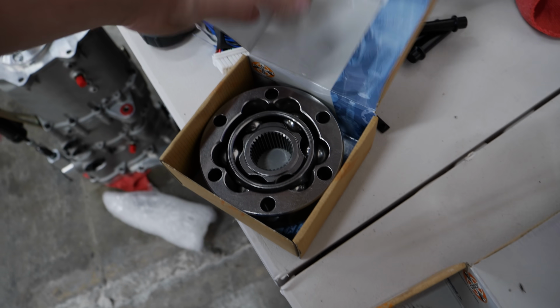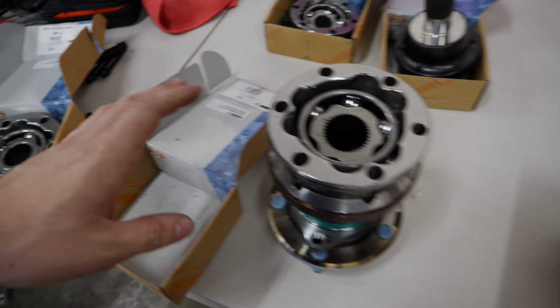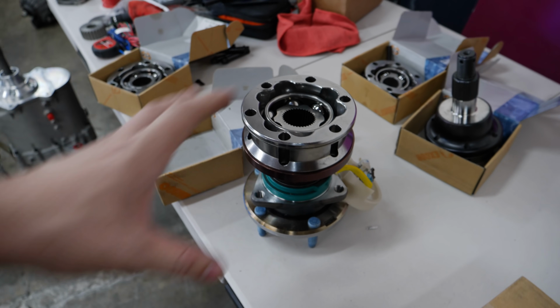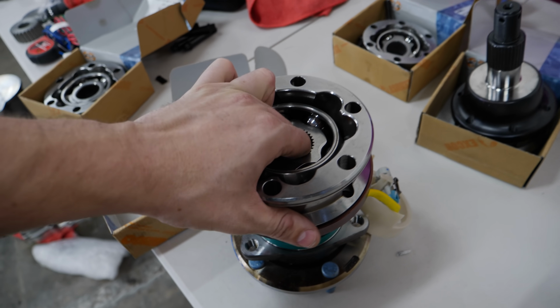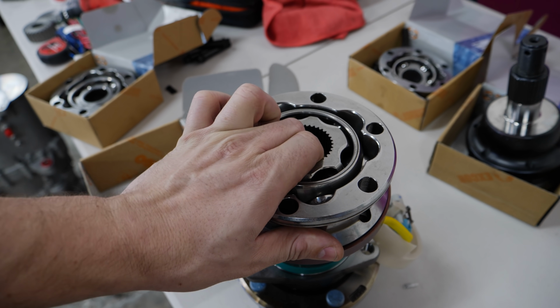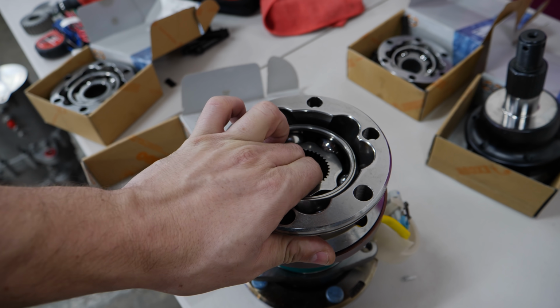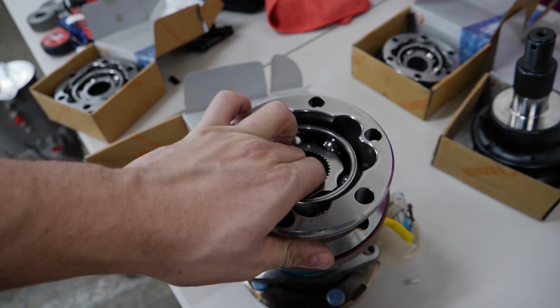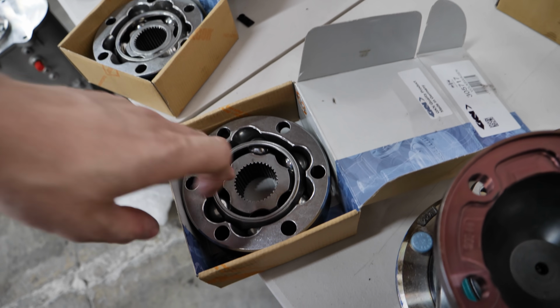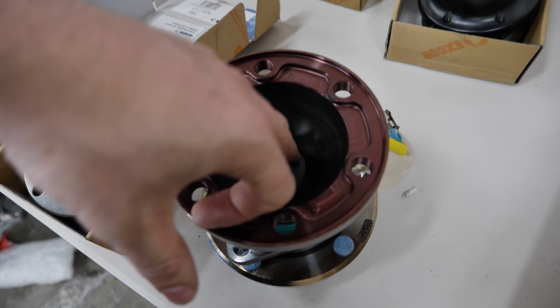So I got 2 of those, plus more bolts for those, because Monday in comes the guys to install the carbon fiber drive shafts and carbon fiber axles. So I had to get all of this to the correct pieces. The axle actually has to sit right there. This plunging action is meant for give and take. You can't just have it at the extreme here and then bottom out and you slam into the metal. This is a cup because the end of this stub axle that goes through here has to have room to move like that.